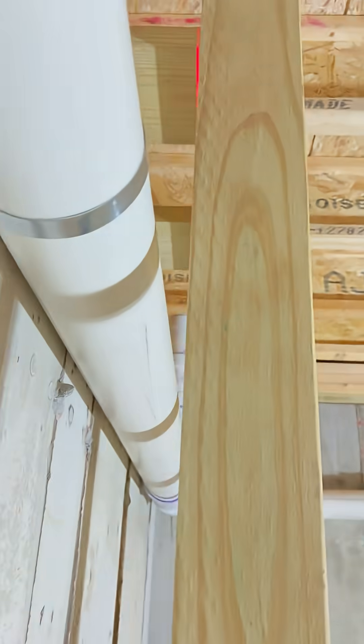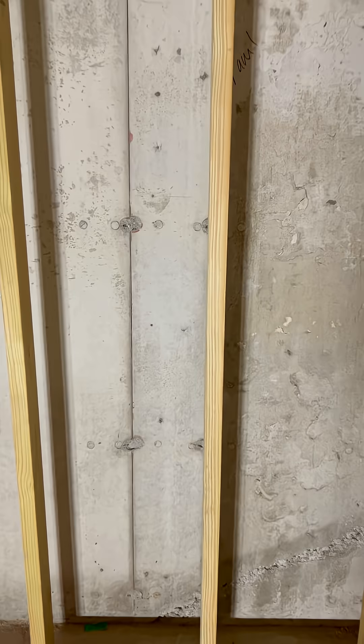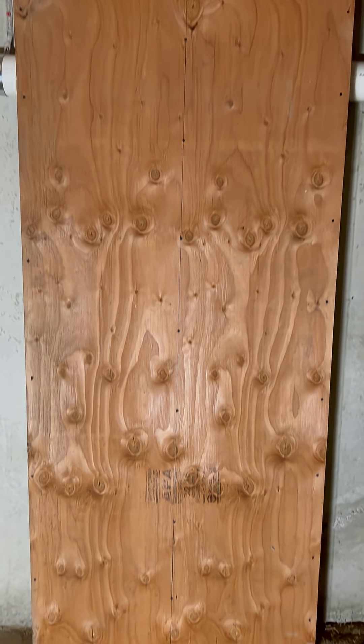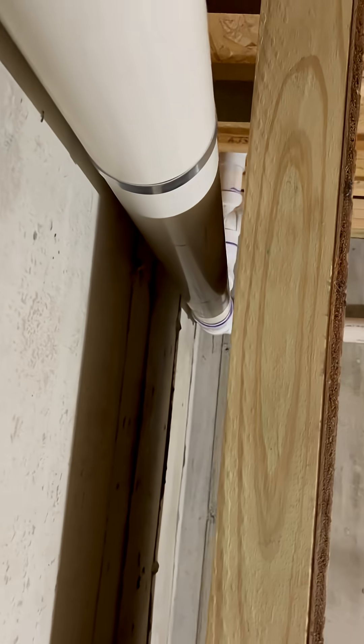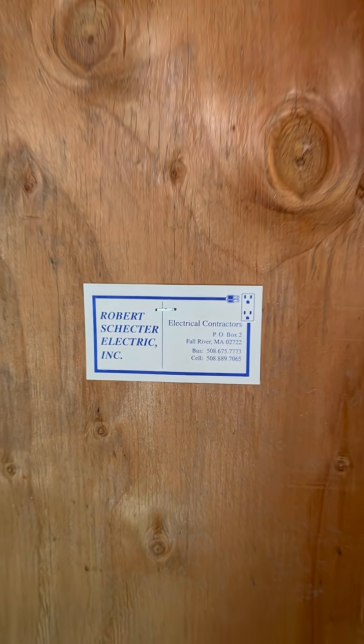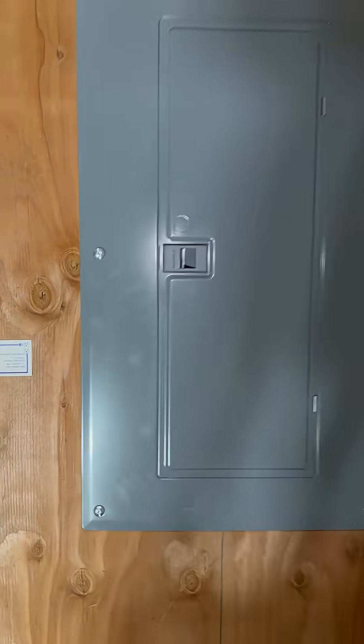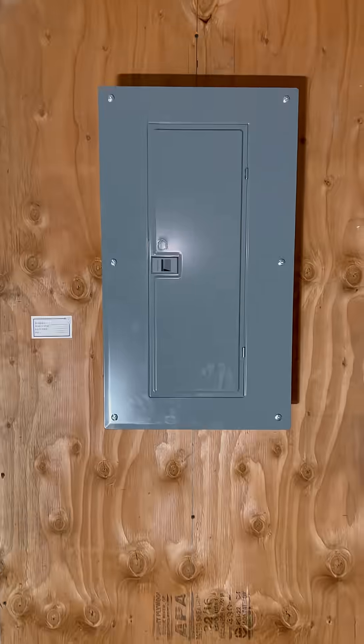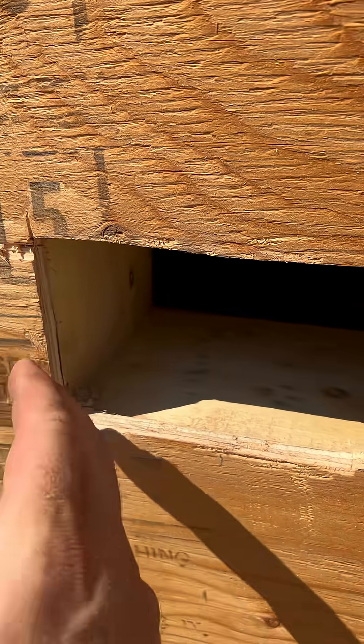Now I'm going to build the wall for the other sub panel that's going to go in the basement. I like to use a laser because it gets me perfectly level and perfectly plumb, setting me perfectly in front of that four-inch sewer main. You've got to be in front of it — you can't be behind it, because if that sewer line were to break it's going to fall on top of the panel. That creates a safety hazard; obviously electricity and water don't mix, so that is a code requirement. I like to build the board all the way up to eliminate that factor.